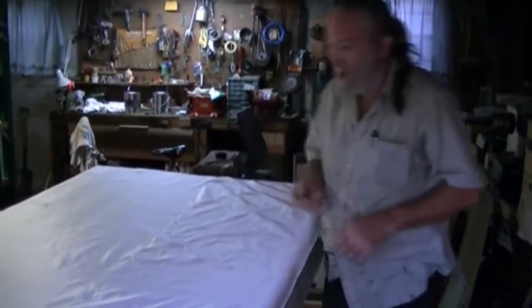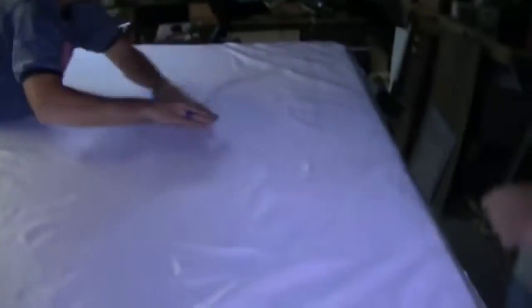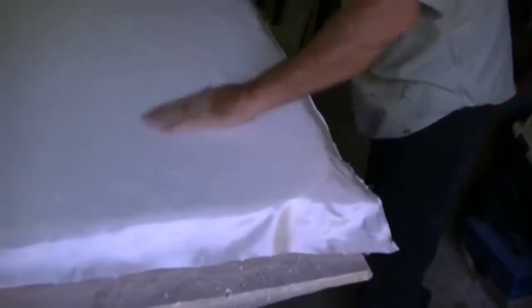At this point we're glued up with the panel. We've got the metal insert on the inside, and this is not one but two layers of cloth that we're putting on now. With it being dry without the tackiness of resin, you can see it works a whole lot easier — the cloth smooths out without fighting you with wrinkles. But it's getting late in the day and we've just about lost sunshine, so we'll put the resin on tomorrow and let this cure, do the other side, and then hopefully we're done with this little project.